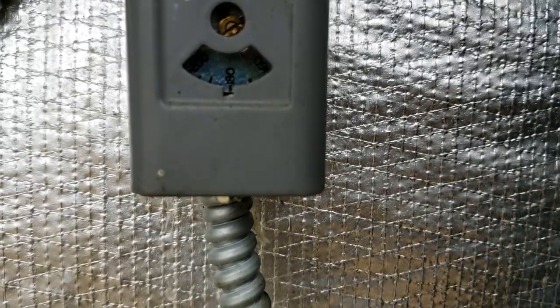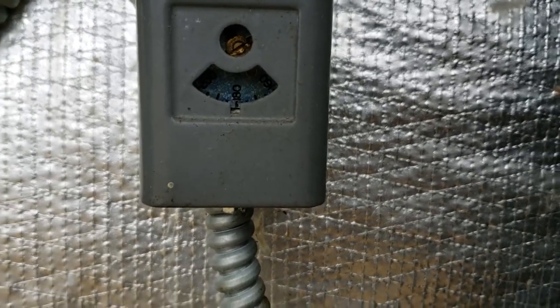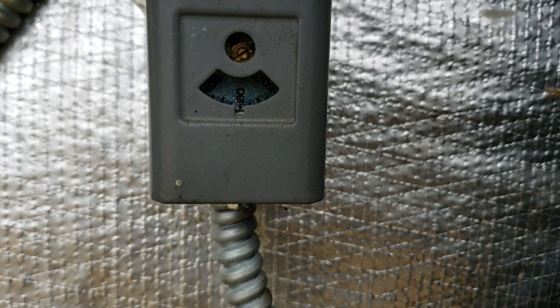All you have to do is grab a screwdriver and adjust that down a little bit. I don't need the water to be that hot. A lot of people had talked about using a mixing valve and other things like that, and I really think with this, I can just adjust the temperature here, 160, maybe even 150, and just see what works and what will keep that bed warm.